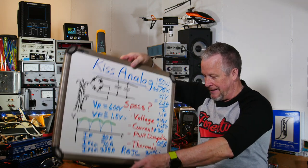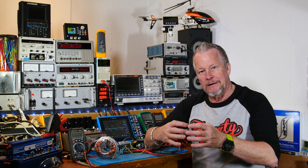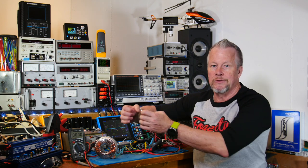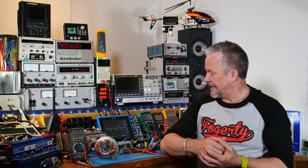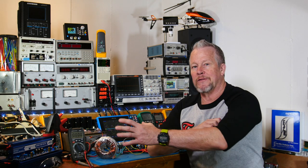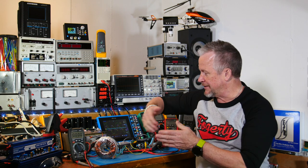I hope this helps you understand how to select a diode. A lot of times you'll see bridge rectifier units — four diodes in one package, usually with a hole in the middle to mount to a heat sink. These are discrete diodes, four per side, so you could replace them with two bridge rectifier packages. I mounted mine vertically so I could put heat sinks on them if needed once the amplifier is running and we see how much current they draw.